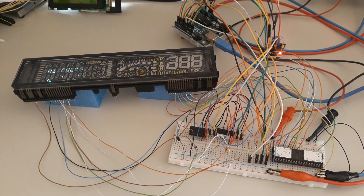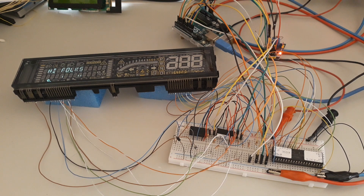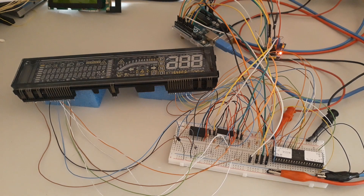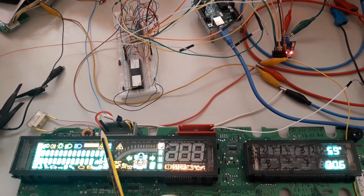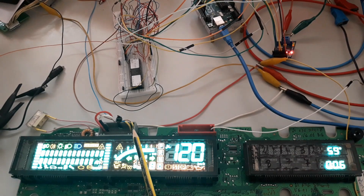There may be a conflict with the names I assigned to the control pins — I used for example CS for chip select and CE for chip enable, but that is not important. This VFD is unusual because it uses chip-in-glass technology but the control of the grids is external and independent; for this reason we need to use the SN75518 to control the nine grids. To power up our panel we have plus 12 volts DC at the first pin at left and GND at the second pin. On the right side we have the CAN bus high; the second pin at right is the CAN bus low.